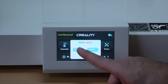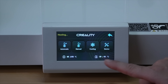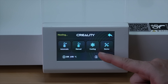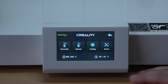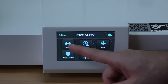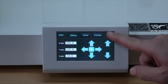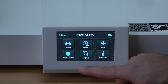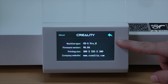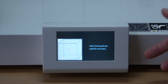Let's click on the Leveling button — it's going to home first. After homing, we have options: adjust Z offset by 0.1mm increments up or down, an AUX Leveling button for manual bed adjustment, and a Measuring button for auto bed leveling. The AUX button gives us 5 manual adjustment points. The Measuring button does the auto level — there are numbers in a 5×5 grid showing 25 measurement points, which appear to be preset at the factory.